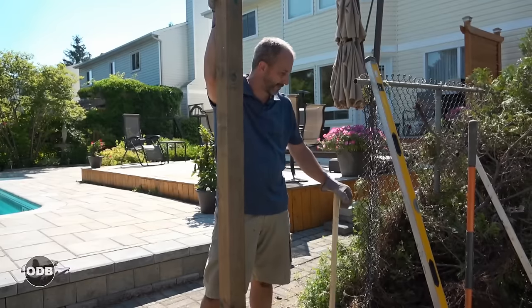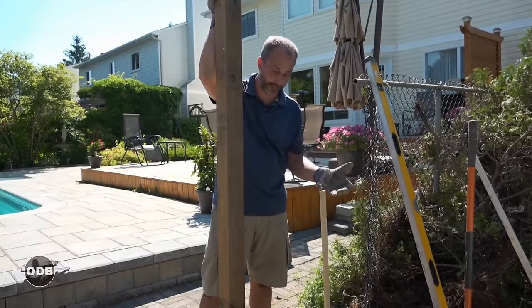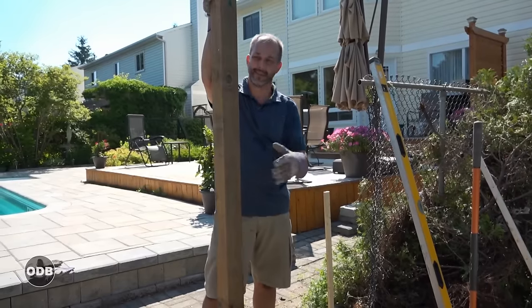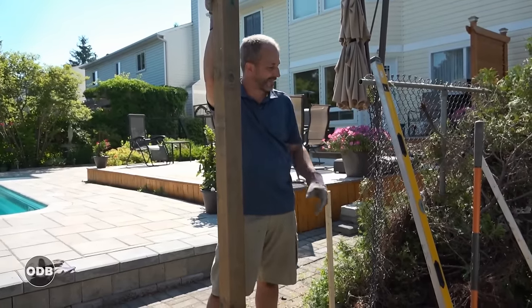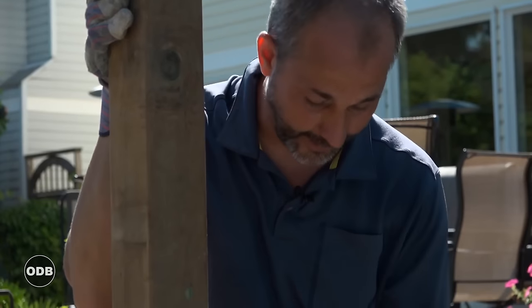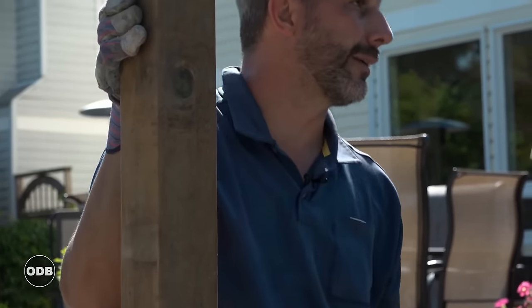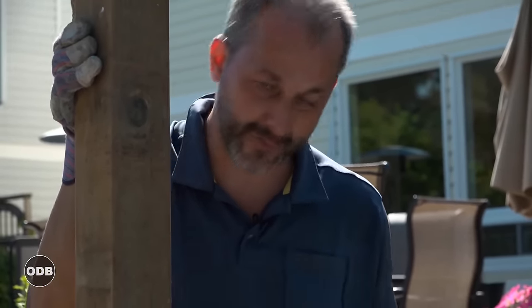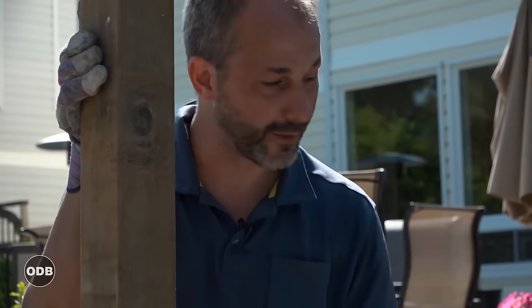The trick and secret to this is that you don't have to mix your cement in a wheelbarrow. You can use regular cement first and if you set your post properly and let it dry overnight you'll be just fine. I like this product for the convenience. Because of our clay we're getting water pooling in the bottom of the post hole already, so we don't have to wet the hole first. If you have a different soil condition you might want to add some water first and then put the bag in.